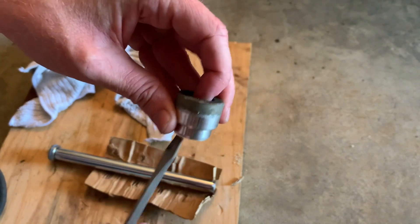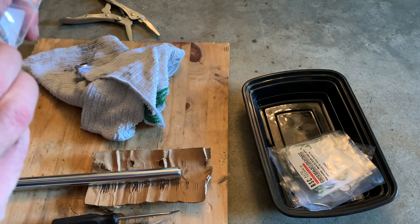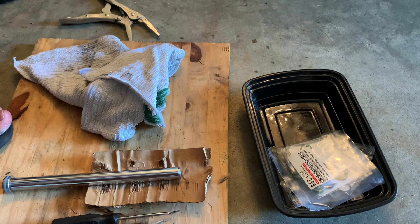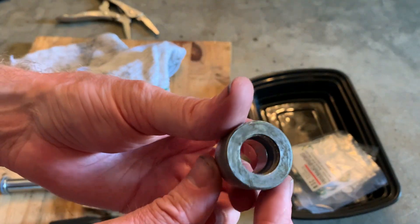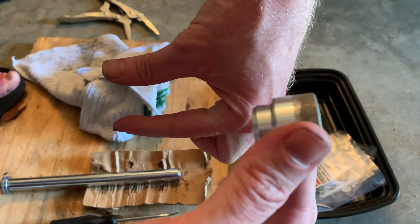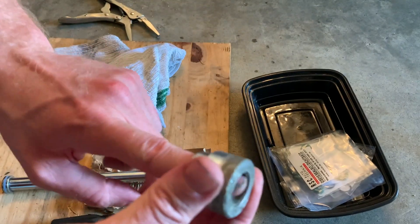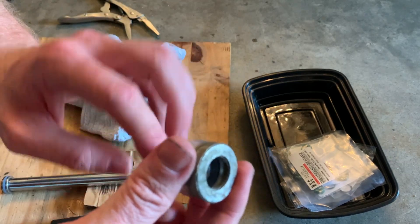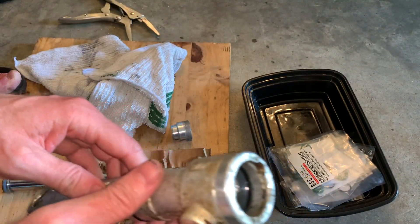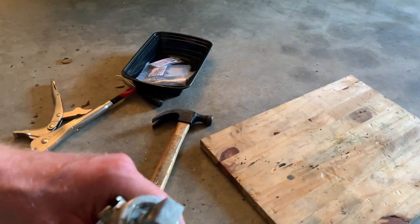This is a live look. This one has been cooling so we're going to set this down - in here is the doohickey we're working with. The seal is probably more deteriorated because I heated it to a thousand bajillion degrees, but clearly it wasn't working anyway because it was leaking. I want to say it has to go like this. I put it with the U facing down this way - if it's pushing up, that U needs to push the fluid into the cylinder and not go past it, because it needs less pressure to go back down.